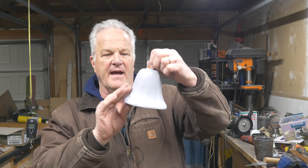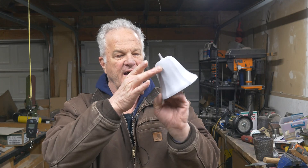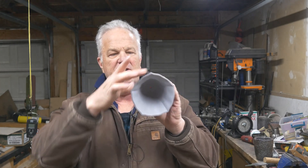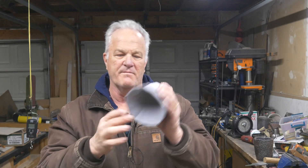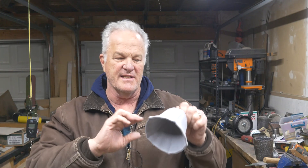What I ended up doing was creating a bell. It's got these sharp ridges on it — you can see them here. And then there's also sort of a gentle flute in here, a little ridge, maybe a lump. It's not round — it's round-ish but not round. And so I couldn't make this with a typical strickle setup. A lot of larger bells especially are cast that way with a strickle.